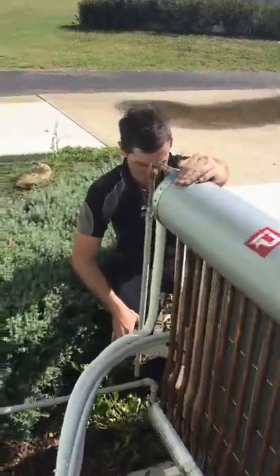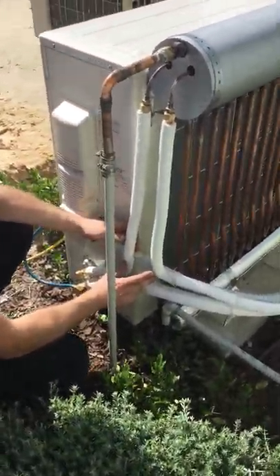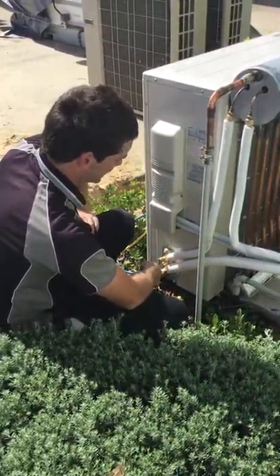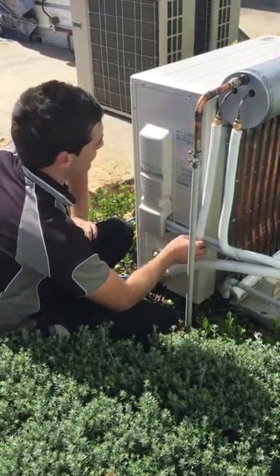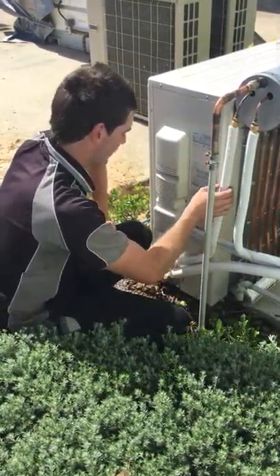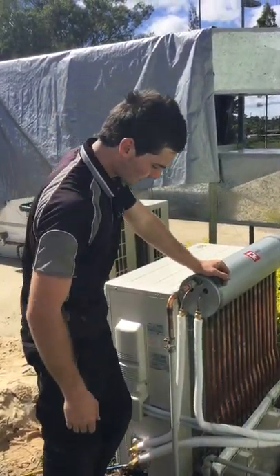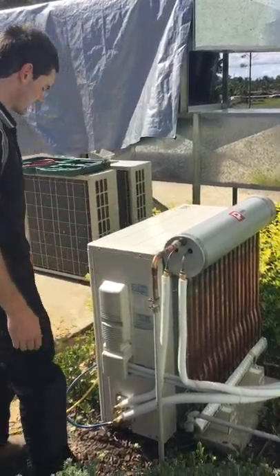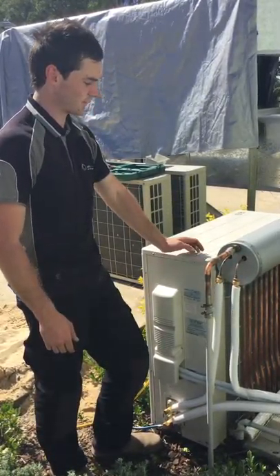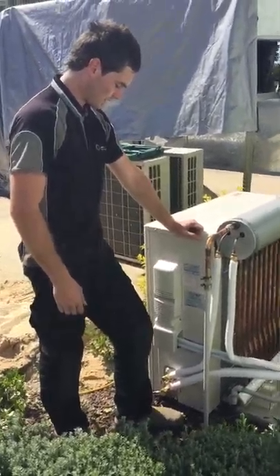What we've done here is the liquid line would be separated — it's like any other normal air conditioning system. We've just utilized the liquid line as we do with on-site installations to make this possible, and they're all flare and weld connections just like a typical refrigeration system. We've also backed the system out just like a typical air conditioning system — the circuit is all still the same, all one circuit — and now we're ready to commission it.